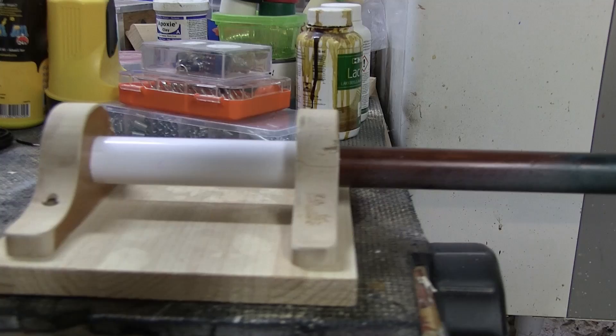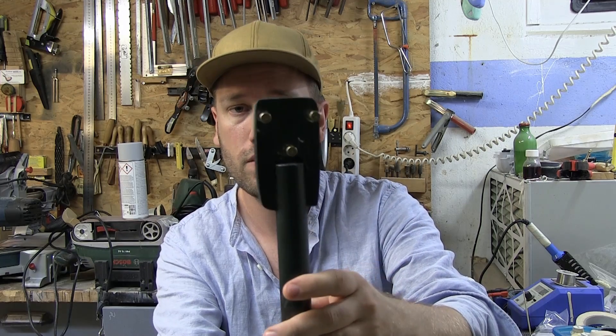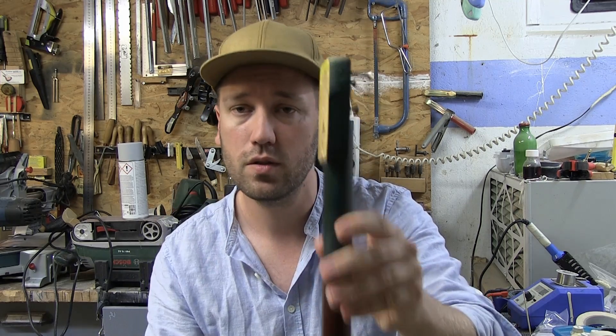If you look at some of my first videos you'll most likely see that I spray painted in a way that I don't do any longer, and it all comes down to this thing that I have right here. This is what I use now, and it is one of those things that I showed you in one of my guitar builder's life hacks. This is my guitar body holder — I drill this into the cavity of the neck and that lets me hold the body in place. It's super simple to make, basically made out of two pieces: a rod of wood with a piece of wood with three screws in it. I attach this part to the body.